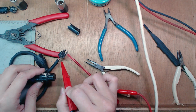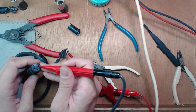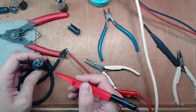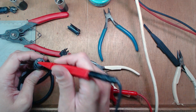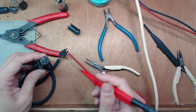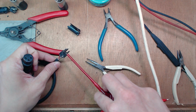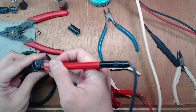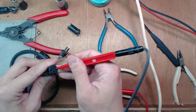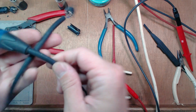We've got one probe on the ground shielding, so that's pin number 1. So that's what we want. We want to hear continuity, right? You can definitely check for shorts. If you probe pin 2, you shouldn't be hearing anything. If you probe pin 3, same thing, you shouldn't be hearing anything, right? So 1 to 1. Hot signal number 2 is to 2. Good. And then cold signal number 3. And then I'm just checking the others for shorts. So at that point, you can definitely close this cable up.